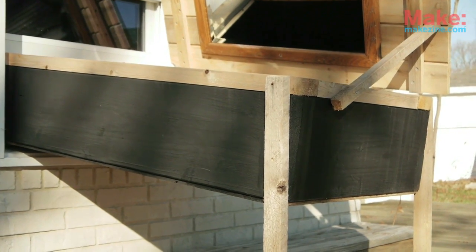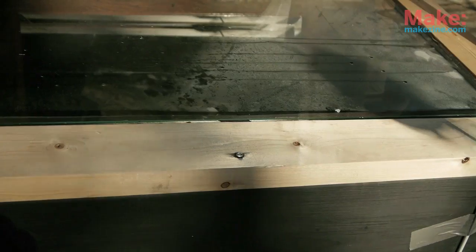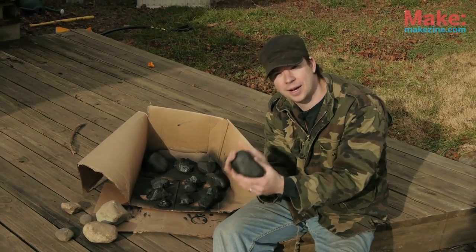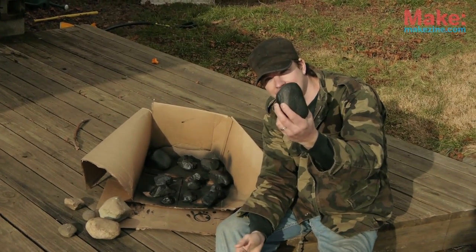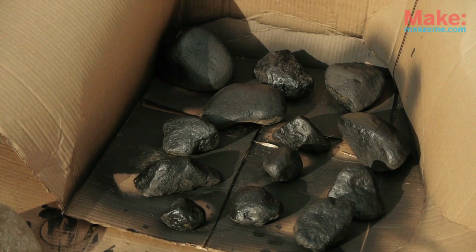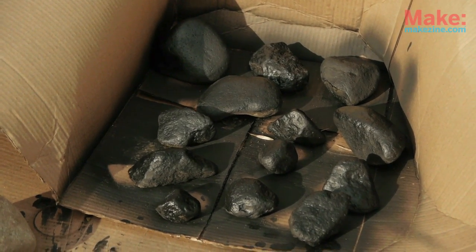The key is painting things black. If I had to do a little more to this, I would paint these black as well. By the way, side note: if you want to retain some additional heat by means of thermal mass, take some simple rocks, spray paint them flat black, and fill your collector with them. As they absorb the sun's rays, they will slowly release the heat later in the night when temperatures drop even further.